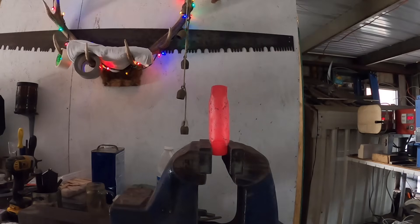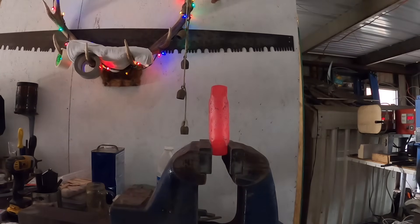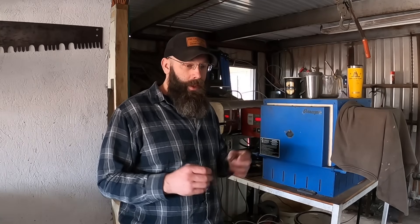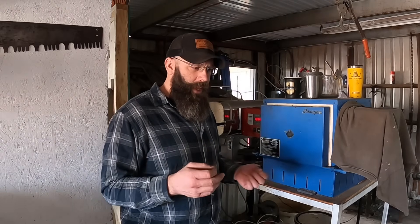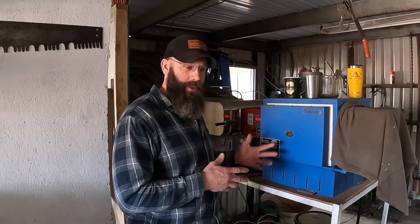So what I'm doing with these thermocycles is trying to grow whatever is already there. The way this works is that you're heating the steel up to a temperature where the carbon can move in the steel, and carbon in steel is going to migrate toward existing carbides and make those carbides larger. The carbides tend to form around carbide forming elements such as vanadium. W1 is a good candidate for this project because it is high carbon — over 1% or right close to that — and it has some minor alloy components that are carbide forming elements we're going to make use of.